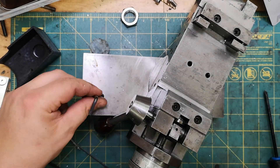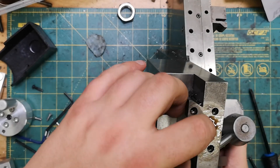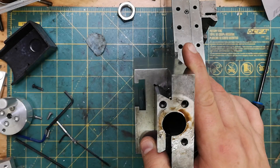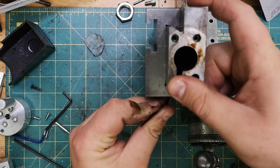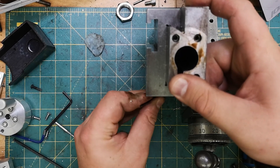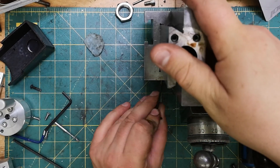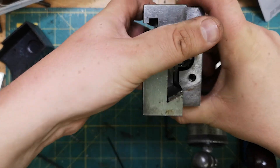I really admire the fit and finish on this machine, and someday I'll go through it in a lot more detail, but for now we can just enjoy how well everything fits together. An example of the excellent engineering is that the cross slide nut actually enters from the side through the dovetail, and rather than having a large slit go all the way down the dovetail, they match-ground a tiny insert that goes in the side and provides a lot of rigidity, so half the dovetail isn't just hanging off. This machine poses some interesting safety challenges from a disassembly standpoint — while all the edges are deburred, they can still be pretty sharp. Many surfaces have very little clearance between them, and the risk of pinches becoming shears is quite high. You can see that I took my time and loosened the jib quite a bit before I tried to take the compound slide off.